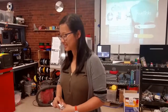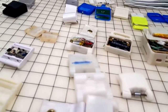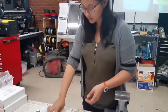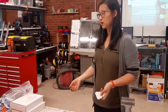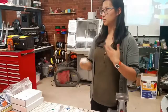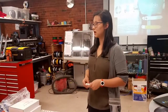It is a very expensive process. Before we get to injection molds, it's a process of 3D printing, testing, and a lot of prototyping. Some of those are just solid pieces of plastic — you put it on a brace, give it to someone, and ask how it looks. We test different ways of attaching it. We also have more electronic prototypes with circuit boards. Essentially, you get closer and closer. We 3D print the device as close to the final look as possible, give it to people, and ask for feedback: how is this working, what do you need, how can we improve it? That's what we do before we drop $100,000 on injection molds.